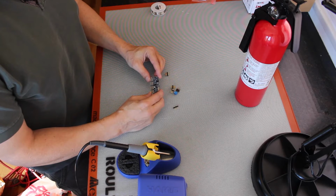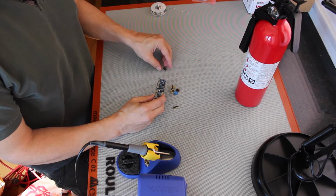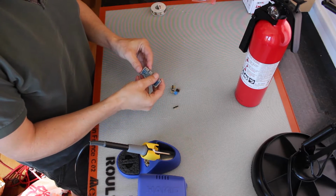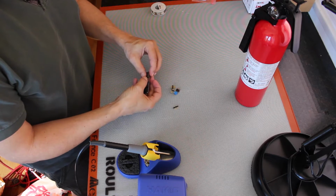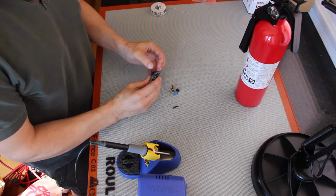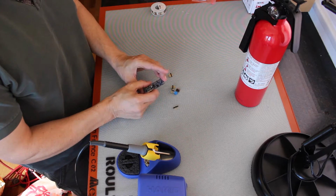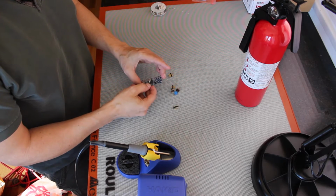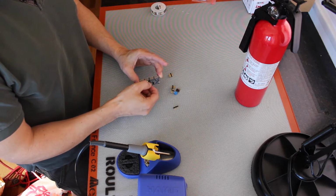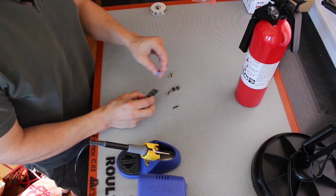But I only need to drive a few of them, and this is much more convenient than using the GPIO pins and the PWM service on the Jetson itself. In any case, you're going to have to drive the servos themselves with an external power source, and this board has that capability built in through these little terminal blocks.